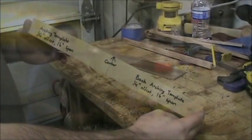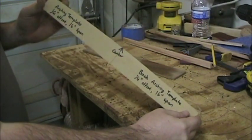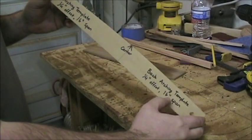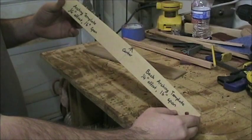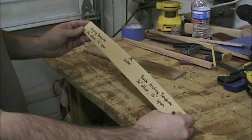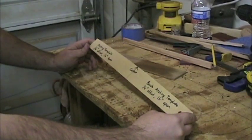This is the arching template that I've got. I made this — I'll show you how to do that really quickly. This is a quarter inch offset over a 16 inch span, which is what I wanted for the back. I wanted about a quarter inch of bump in the middle for that to pop out. On a back you can get pretty liberal.